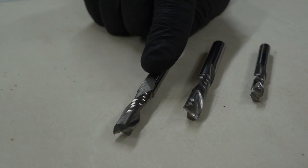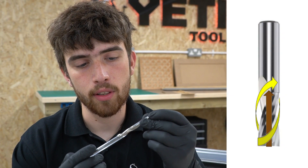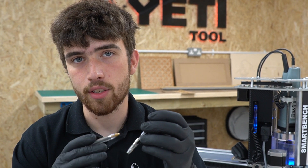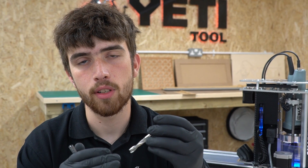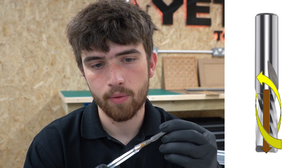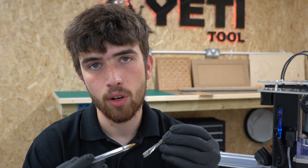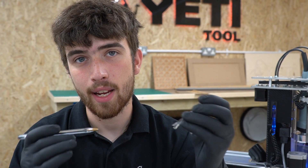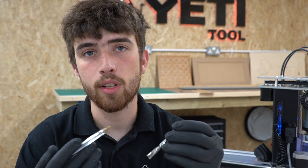Within spiral cutters there are a couple of different configurations. You have spiral up cuts, spiral down cuts and compression cutters. A spiral up cutter has flutes that wrap around the body of the tool in a clockwise direction. When the spindle motor is also spinning clockwise, these flutes and cutting edges pull the material and chips upward — great for chip evacuation and gives a very clean finish to the bottom surface of your stock material. In comparison, the spiral down-cut bit has flutes that wrap anti-clockwise. When the spindle is spinning clockwise, the cutting edges push down into the material, giving a better finish on the top surface. However, a major downside is that this compresses chips into the slot of your cut, which can cause job failure in a worst-case scenario — though this is dependent on the material and sometimes the benefits can outweigh it.